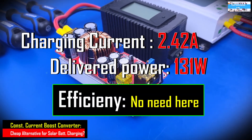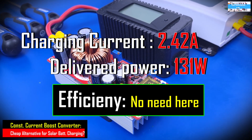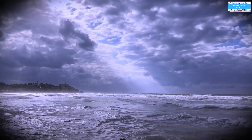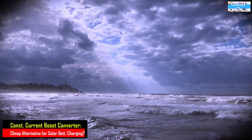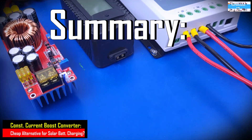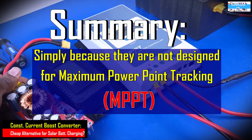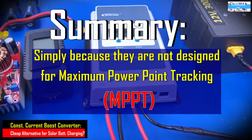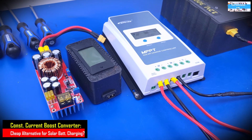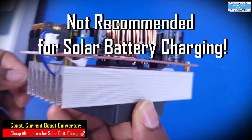When making current adjustments, if you attempt to exceed the available power coming in from the solar panel, the DC to DC boost converter gets confused and the output current regulation crashes. You have to go back all the way down to zero and repeat the process — and this will also happen when a cloud passes over your panel and the energy reduces. My summary is that the constant current DC to DC boost converter, as cheap as it is, will not be able to replace the MPPT solar charge controller for this function. I would not recommend this for solar charging because there will be lots of energy wasted and lots of time wasted trying to manually adjust every single time.